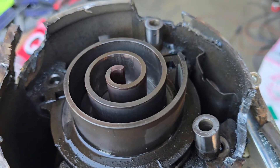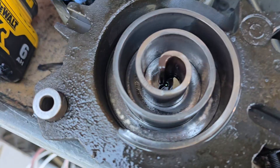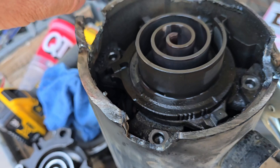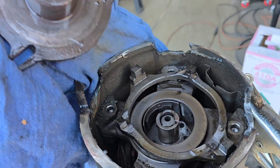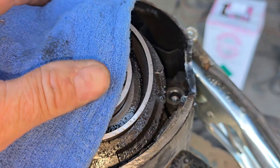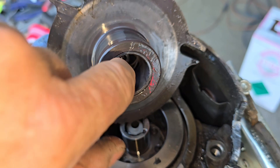I've seen these torn down quite a bit. There's like a coating — think of like rod bearings or main bearings — there's like a coating on some of this. You can see when it really makes contact and starts to wear horribly, but nothing's obvious actually here at all. So it might not actually be this section that's foobar. Stuff's still a little warm — used plasma to cut through the last bit. That might be metal to metal right there — let me shine some light on this. Doesn't feel all scratchy or anything.